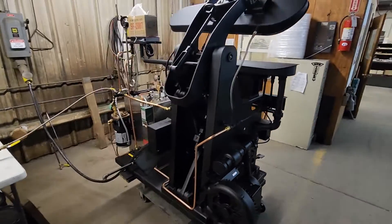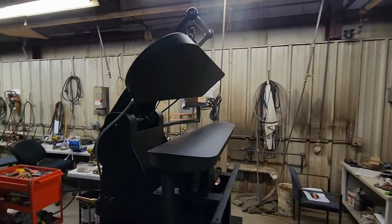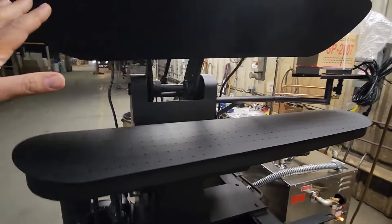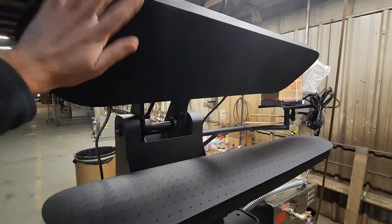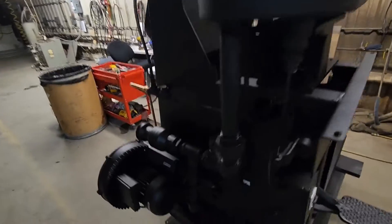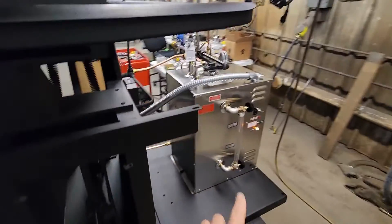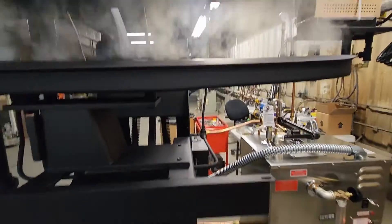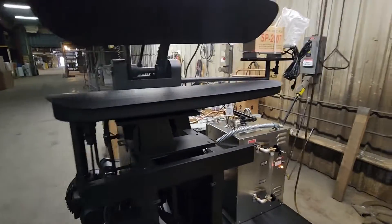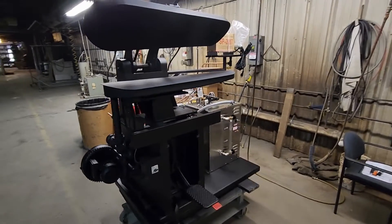That is the basic quick start guide for the Unity Model H machine. A couple of notes on variations: we make a couple of different heads and options. If you order it with the laundry head and buck, you'll get a chrome-plated head without spray steam and a solid buck without spray steam. The laundry machine also does not come with the vacuum option. Instead, the boiler serves only to circulate steam through the head and buck to keep the machine warm — you also won't get the extra spray steam pedal. As always, if you have any questions, call our technical support line or contact your sales rep and we can get you in touch with the guys that build it.